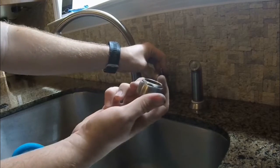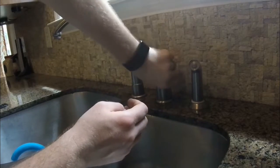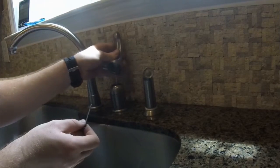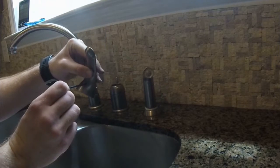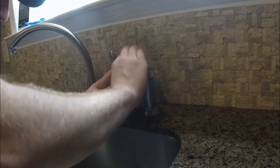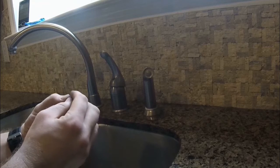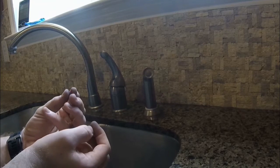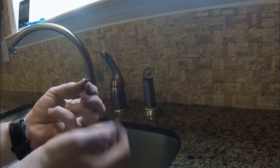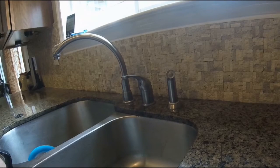Now that you've got all the seals in place, take the dome and press everything down. You're going to be able to screw the top of that decorative piece down. Take your lever, line up the hole with the end of the stem, and get the flat section of the stem roughly aligned with the set screw — once you start to tighten it down, it'll self-align. Tighten the set screw — not too tight, but enough that you won't remove the handle by accident. Then take your hot and cold indicator rubber grommet and press it into the hole, covering the set screw. It has a tapered surface, so make sure it's lined up correctly, and it should press in fairly easily.